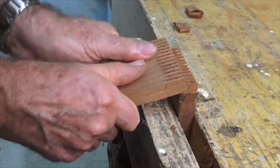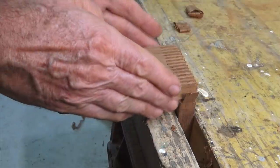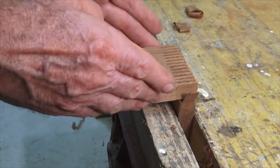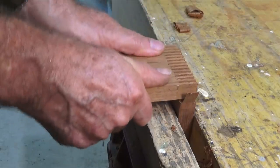These finger joints have got an insane amount of strength when you put them together, and that's because of the amount of gluing area that you have with all of those surfaces. Now, the downside is that they take a while to set up. Although the jig that I use looked very simple, getting it tapped in so that all of these sockets and pins work out to be a neat fit is quite difficult.